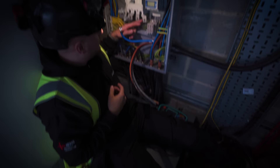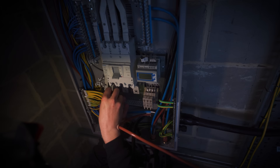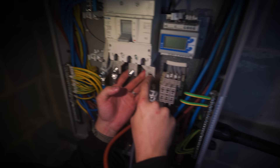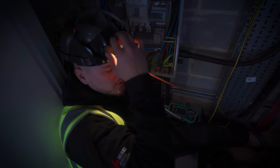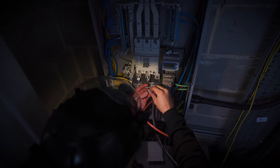I've numbered the lug with one dot — I'll do one, two, three, four. Just like if this comes off, I'll know it's got one dot so it's neutral. Two dots will be on there for the next. These have a bolt without a head because it's not necessary — they're called a coach bolt. You've got that square plate at the head, and if you orientate it the right way, it sits within this square so the bolt's not going to twist. You don't need anything around the back to hold it because it's locked in. That's why when they over-torqued these, because there's no play in it, it just shifted the whole thing. I'm certain this was already abused before I got involved and all I did was take it apart, so I'm not really culpable. But that's why it's basically done it.